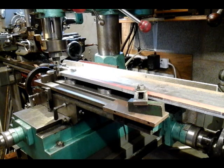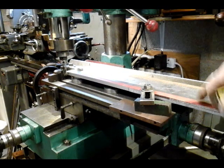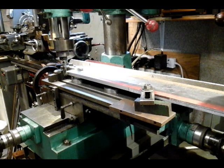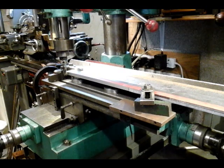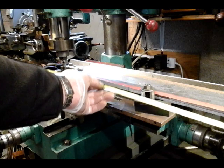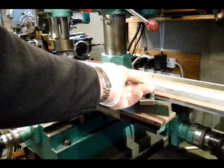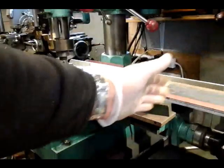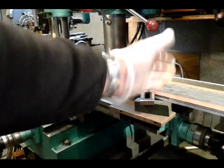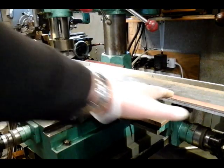With this on a budget build, what I've done here is cut this plate down to four and one-eighth inches wide, as you've seen in part one. My milling machine has only got a 22-inch table but it's only got 11-inch traverse from end to end, so I'm going to do these main frames in three chunks.